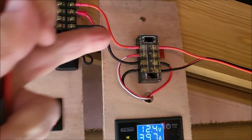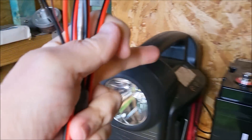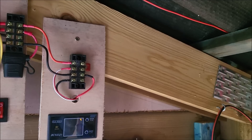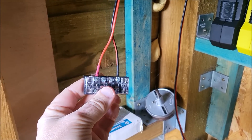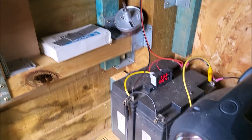It will go from there, that little terminal block, down to here but not onto the lead-acid — onto the lithium. So let's hook that up now. That's the lead-acids disconnected, and so I don't accidentally short them out, I've just put those into a terminal block which is just going to hang there and do nothing.